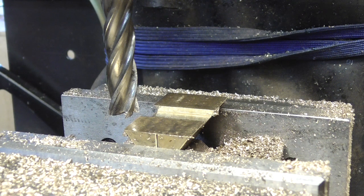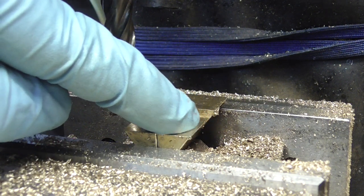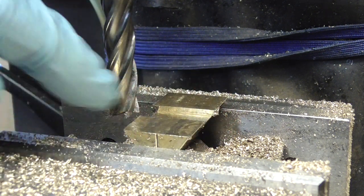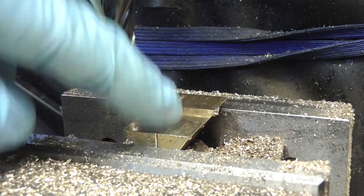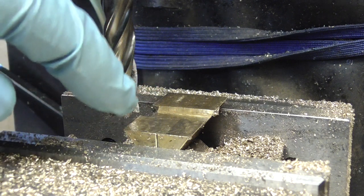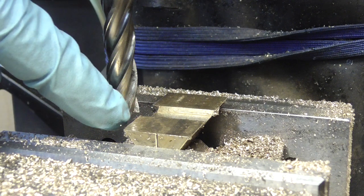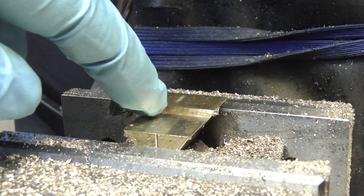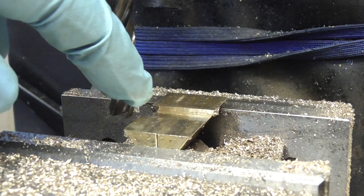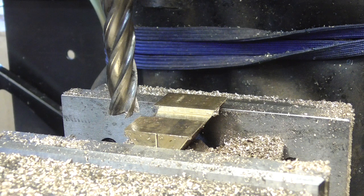So I think that's okay. What I might just do is run down each side and take the sharp edge off. I might have to drop this down in height on the tip - I left it at about 14mm rather than 12mm, purely because the width was getting a bit short. Obviously I've got to bolt this in, so I need to be able to drill it, tap it, and put a bolt hole in it - which will be the next operation after doing this edge work.